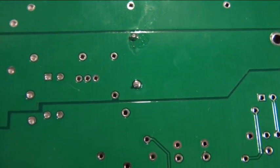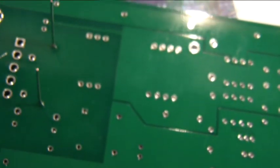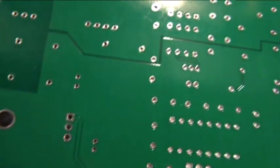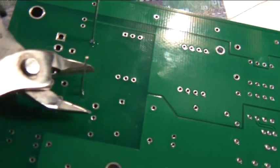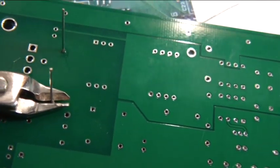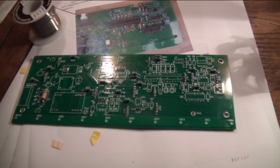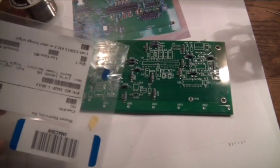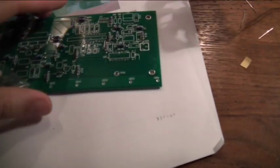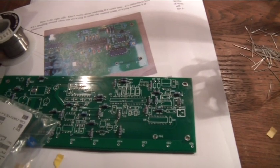Here is a good example — it is not bridged in any way. When we have done our soldering, we clip off the excess part of the legs that is sticking out, as is standard when soldering. Now I am almost done soldering in the resistors. I just need this little trimmer resistor — the last one — which fits in right here. Then I will be moving on to the capacitors.